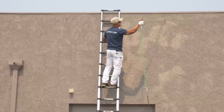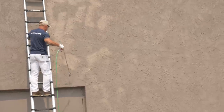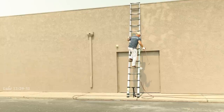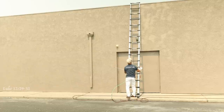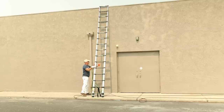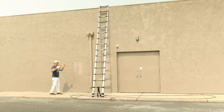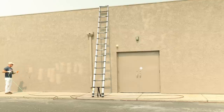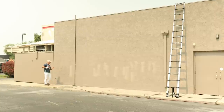I was blessed with painters that actually painted this before, rolling and filling in on stucco. The back rolling process fills in all the little pinholes with paint, gives it a smoother look but still gives you that stucco look. Some people might wonder why — even the customer thought I was going to be using a satin — but I always use flat paints on stucco because I want my stucco to continue to look like stucco. Stucco when it's originally put on is not shiny, it's flat, and I want it to continue to have that flat stucco effect.